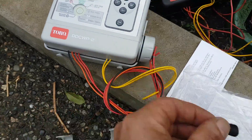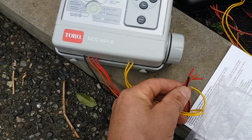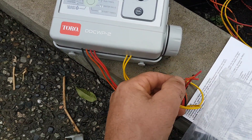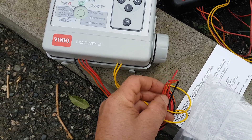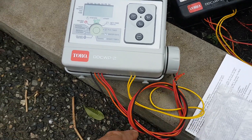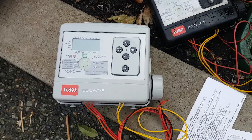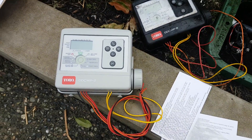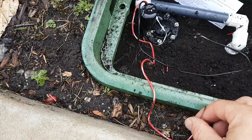These are waterproof wire nuts. What I've been told is the reason these timers are failing is because installers don't put the wire nuts on the ends. I'm going to take the plastic off, fold the wires over, and put a wire nut on — that will stop water from wicking. Apparently water can get in here and travel all the way up the wire into the timer itself and cause it to short out.